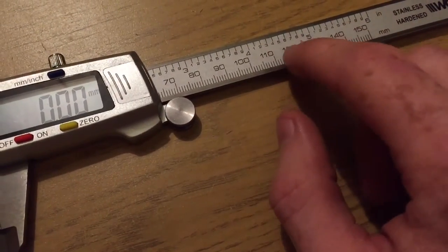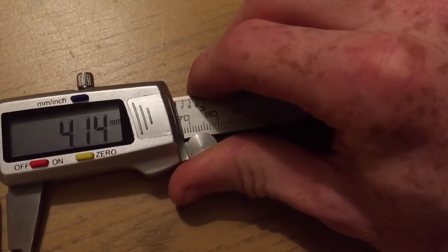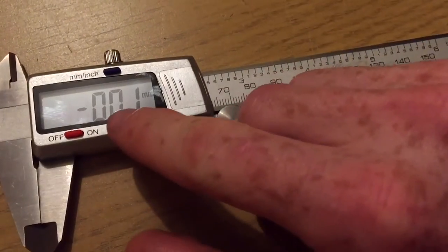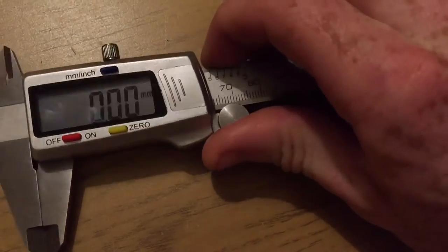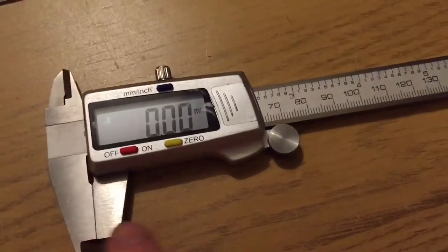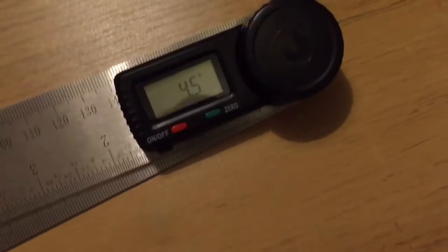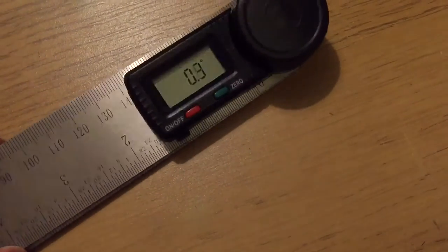These things are so accurate and precise. The accuracy is very good. I've measured these, even the really cheap ones, against a reference length, and they always come out very well, within the precision of 0.01 mm normally, which is really all we can ask for. In fact, these are almost as good as a micrometer. In fact, my cheap micrometer, I don't really use it, because this is just as good. So that capacitance measuring technique is very similar to this, which we'll see in the teardown. But this is essentially counting how many divisions it's going through.